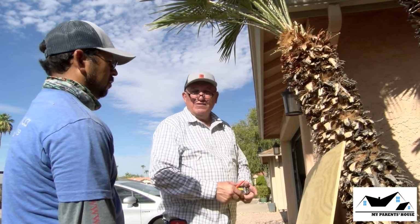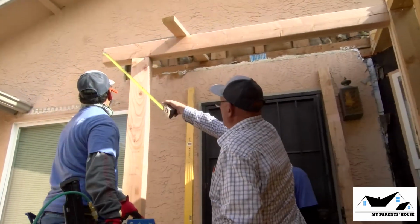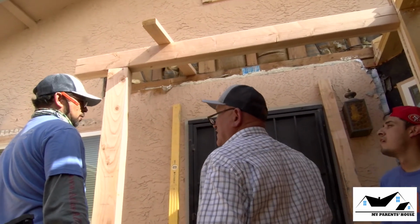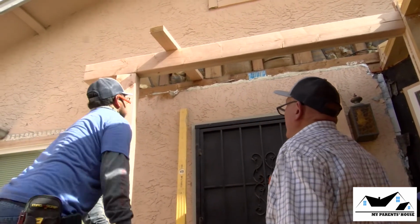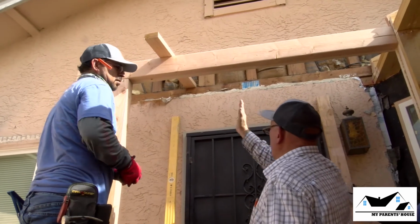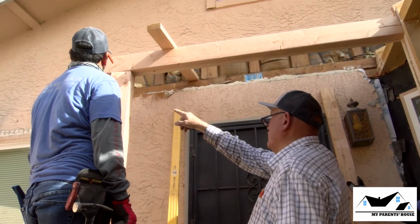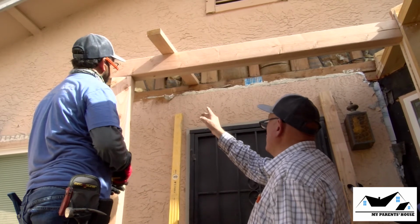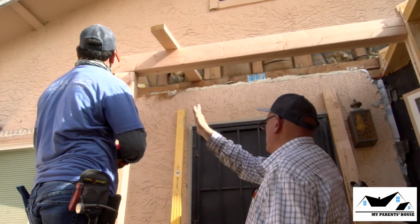Okay. If you have a question, holler at me. Just call me. This cut, I'm at that cut this way, so start to measure this way. Okay. 24 inches. And so when you put this ledger up there, make sure you hang it far enough past that it catches the fascia out there. So you're only going to go about 12 inches on that fascia. I wouldn't go any further than that, 12 inches on that fascia. So this up here will run out 12 inches past.